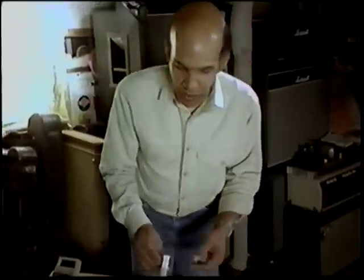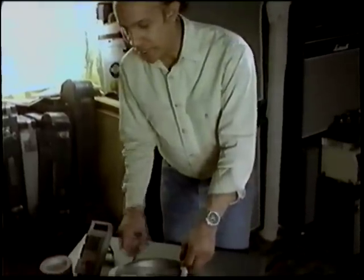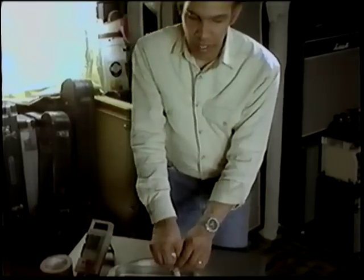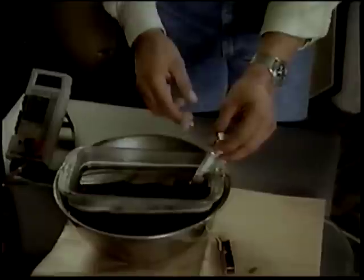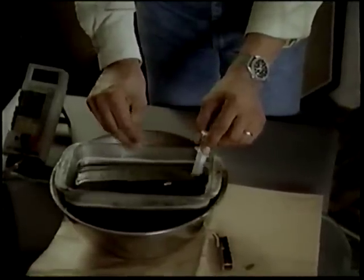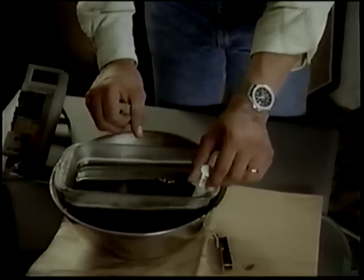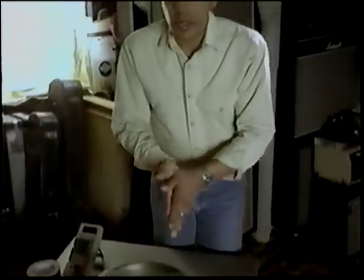You notice we also have a syringe on our side. Sometimes we use a syringe to shoot hot wax inside the coil. But that's not something that you really have to do every day. I recommend that with Telecaster pickups. If you're dipping humbucking coils, make sure you don't dip them too long, because they're made out of plastic and they will warp. Same thing for P90s.